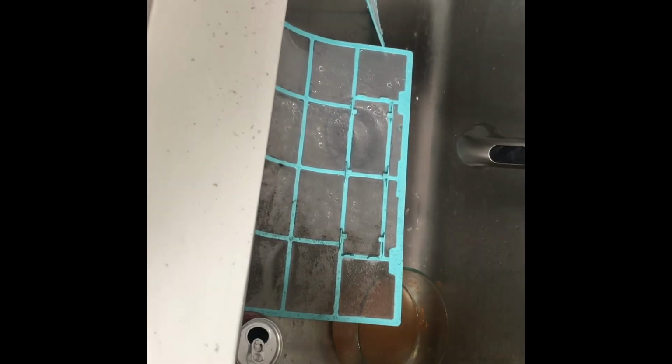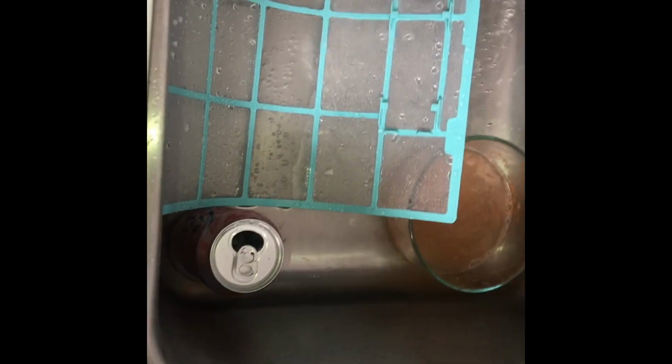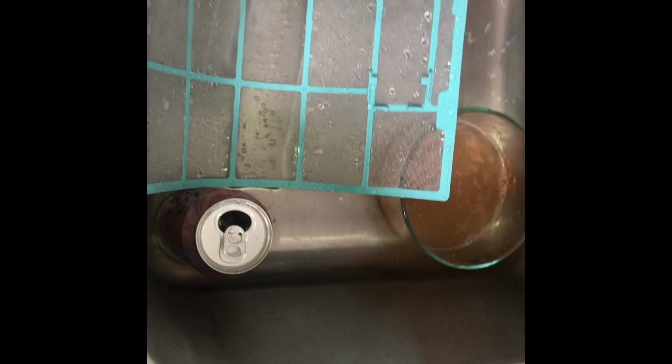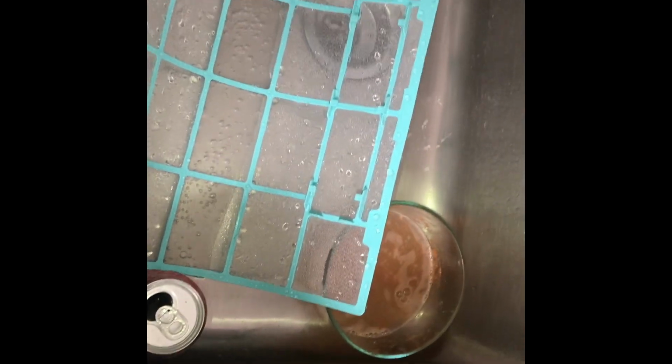This is how you guys do preventive maintenance on your filter for mini splits, if you have one in your home, residential or commercial unit. We're just trying to remove all that dirt. If it's a residential place, the most common question is how often do you wash it? My common response for a residential place would be every 3 months, depends on how heavy you use it. If it's a commercial place and it's on a daily basis for business, and you have clientele coming in, I'll recommend you wash them every month for commercial.